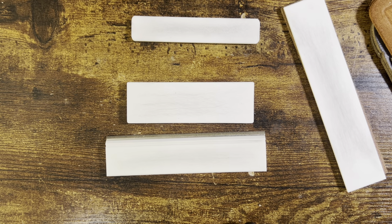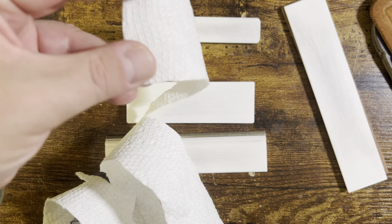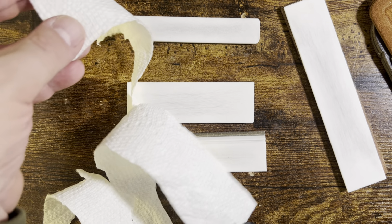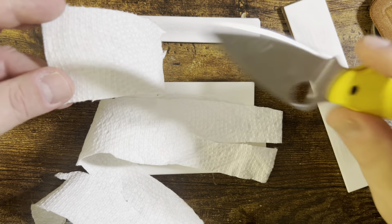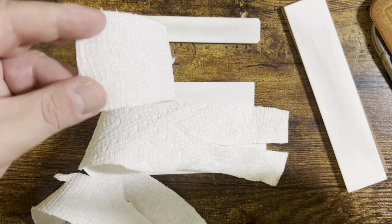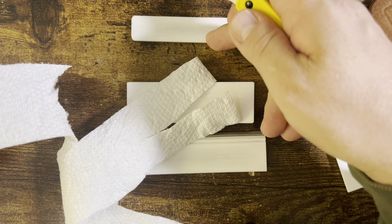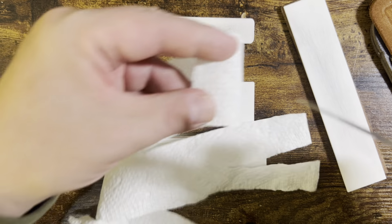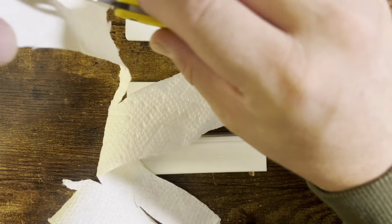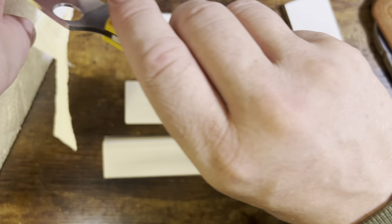Do I have anything left I can cut out of this one paper towel I brought? This here is the wrong one. We will go with this, the Spyderco UK Penknife in MagnaCut Salt. This was done using that method. Hand sharpened on the Sharp Pal, then honed on the EZE-lap on the fine side, then the Spyderco Ultra Fine, and then finally finished on the WorkSharp. And this is just for a hand job. It is not bad.